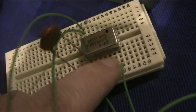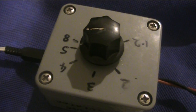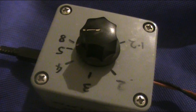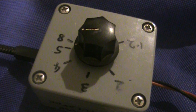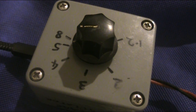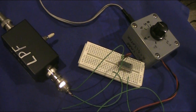And here in the top right is the power supply connection, which you can also key. I am using a 12 volt battery, but I've got in line a variable voltage regulator. Right now I've got it set to 5 volts. The voltage regulator would use a chip like an LM317. So that's all there is to it.